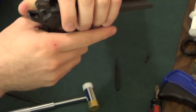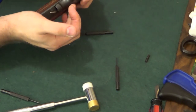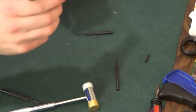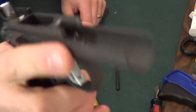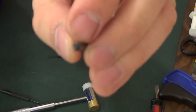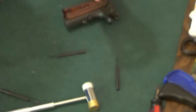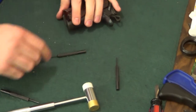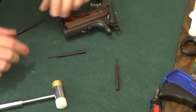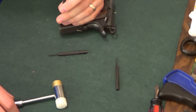Anyway, before you put that in, let's go ahead and do some checking here. Make sure everything's set. Oops. All right. Everything seems to be where it needs to be. Pin, the round side to the right, like everything else. The dimpled side is where you're going to hammer with your pin. Just going to line it up. Tap, tap, tap, tap. All right, once it hits its pressure point, I like to just double check everything before I ram it on home.